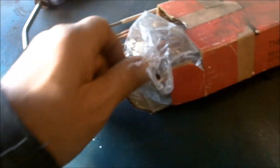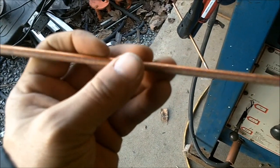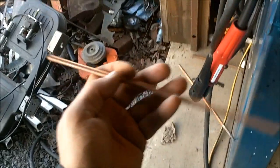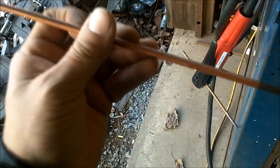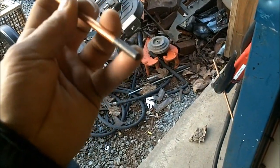The third thing you need is these carbon rods. These are quarter-inch carbon rods. It's pretty well all carbon — it looks copper there, but it's just a thin copper skin. All that copper does is help to get the contact started between the brass and copper fittings and the rod, to get the juice flowing through the carbon. The other benefit of the copper skin is it keeps the carbon from breaking, because it's fairly fragile — it's just a big lump of carbon or graphite.